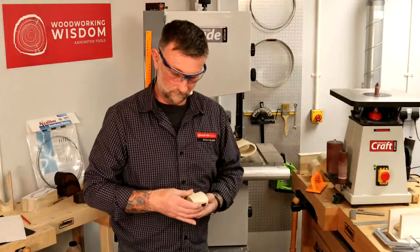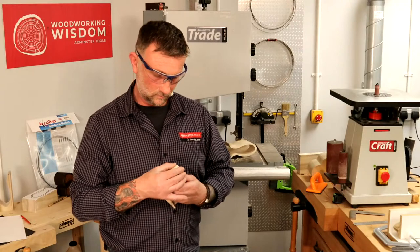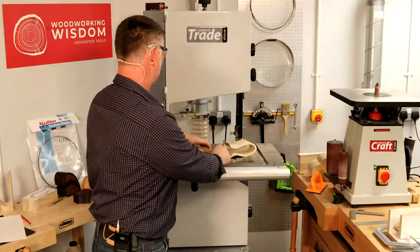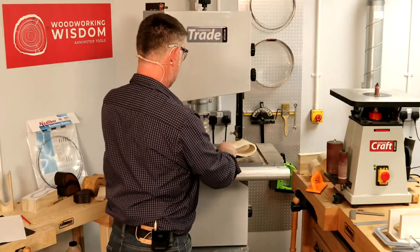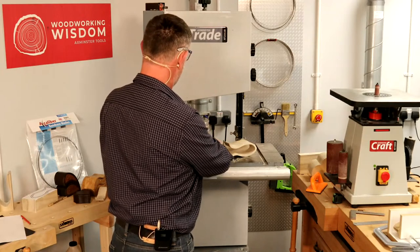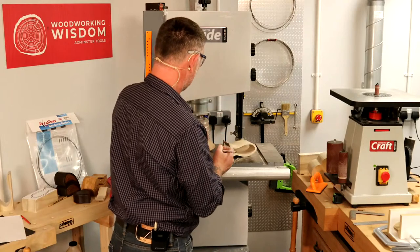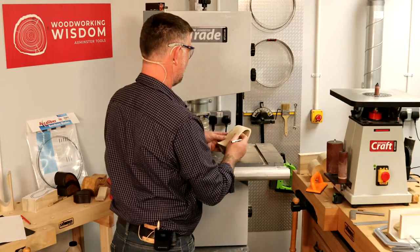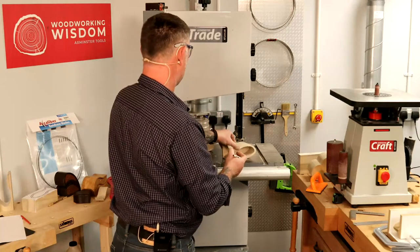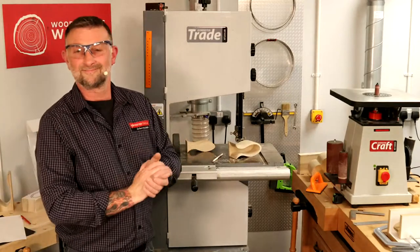Was there a length or limit to the timber that it would hold? There is a limit. It's not something that I can give, though, because it depends on several factors. First of all, the diameter of your project, the fixings that you've used to the chuck, whether you're using the tailstock, all those sorts of things. So always err on the side of caution. Good fixings. Use the tailstock where possible. And certainly that doesn't apply if you're doing coasters and that sort of stuff. But best advice I can give, really.